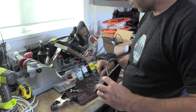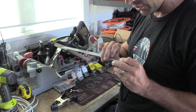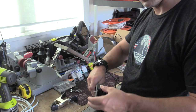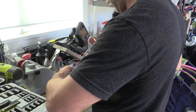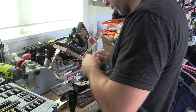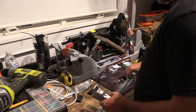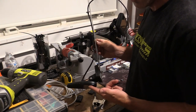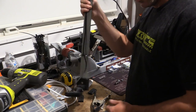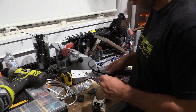I'm going to mount it here like this. It's only got the one screw, so rather than come in with a second screw because it doesn't really want to align well, I'm going to use some silicone to tie this down and glue it to keep it from swaying side to side. The silicone has dried on the transducer mount, so we've got a single bolt and the silicone holding this down. Working on the clamp end of the transducer now — I just tapped the hole here to accept the bolt. It's still a little hot; you've got to be careful when you're working with this.